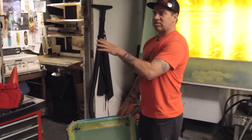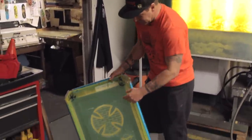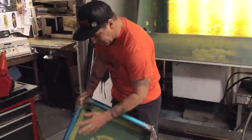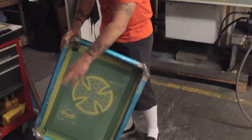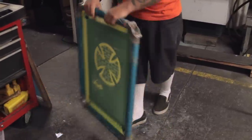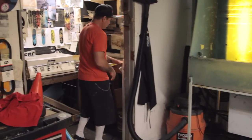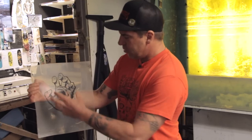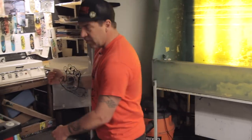What we have here is this is the darkroom where we cut all of our screens for NHS manufacturing. This right here is just a regular manual or automated screen. When we cut screens, we use a film — you use a photosensitive material, you shoot it, the light shoots the screen, the material then bakes, then you spray out wherever the artwork was. So at that point, you have the window where your ink would come through. The light would shoot anywhere you see the art, actually wouldn't penetrate through, then the water would dissolve and wash it out. So then you'd have your window for screen printing.